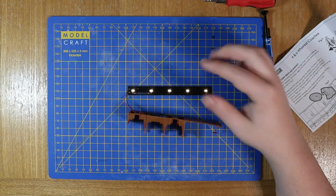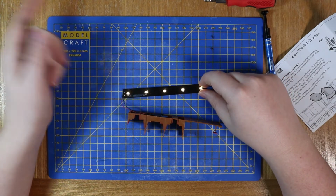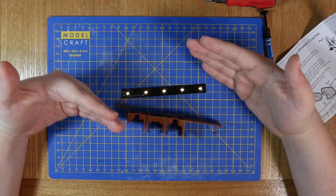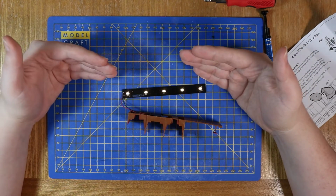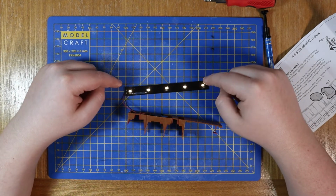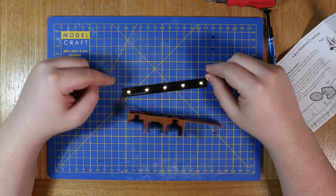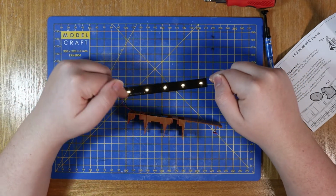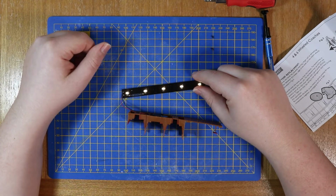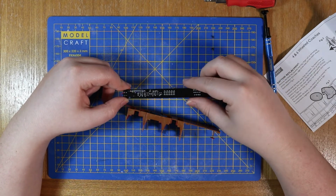I was looking up the reed switch when I first heard about Hornby's new lighting switch using the magnet. I was a little confused because reed switches don't normally latch. The idea is that when a magnet is present, they close, and when it's removed, it opens. So I couldn't see that being some sort of permanent switch. And I have seen basic DIY kits online for coach lighting where they've used a reed switch. They actually say in the instructions that you have to keep the magnet on the carriage to keep the switch active. If you remove the magnet, it turns the lights off. So I'm not entirely sure how they're managing to make it work exactly here.